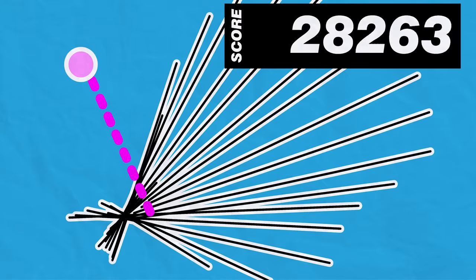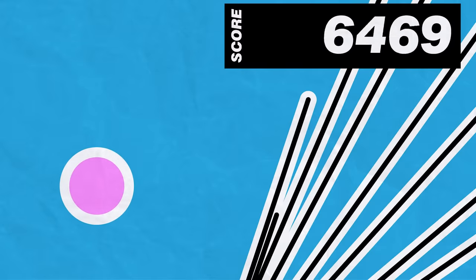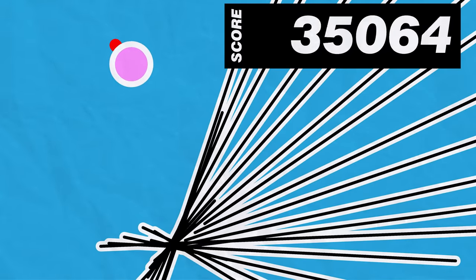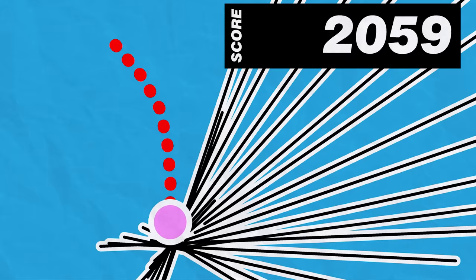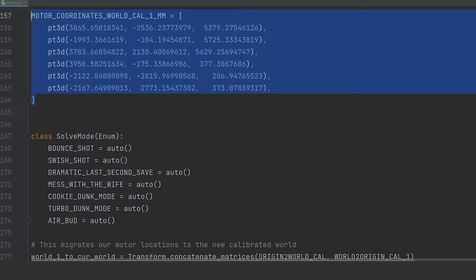We start by taking all of the rays and choosing a random point as a terrible guess for the intersection of all the rays. We calculate how far this point is from every ray and add that up. We want the computer to figure out where to move this point to make this number as small as possible. Our strategy is to move the dot a little bit in all three directions and calculate how this number changes. Then we'll use this information to move the point in the direction that will most reduce the number. If you do this a bunch of times, the point will move until it can't get any smaller, and this is a good approximation for the intersection of all the rays. We just have to do that for every pulley, and bam, we got all their locations.